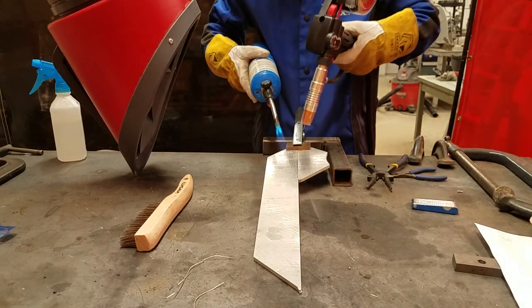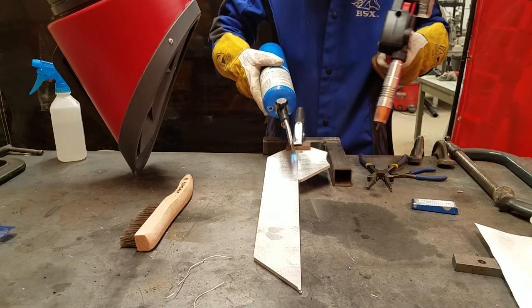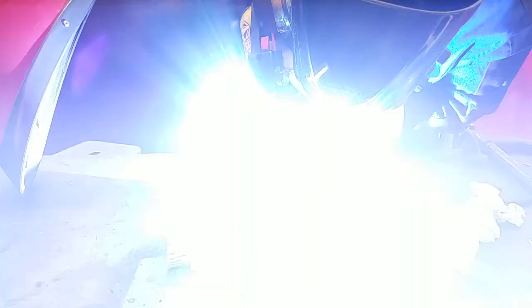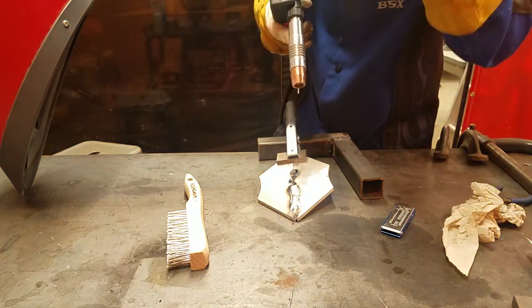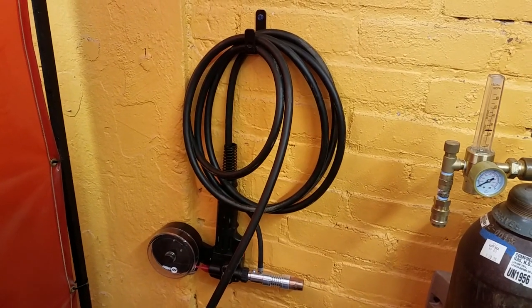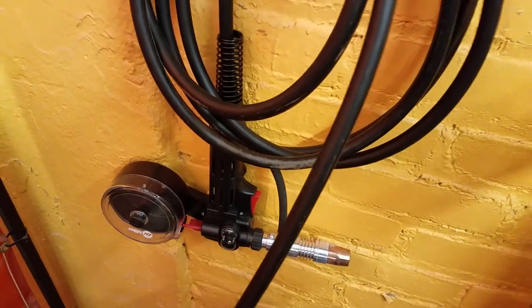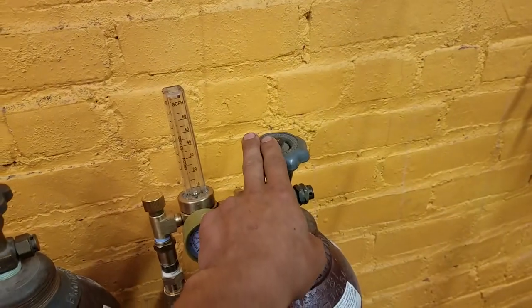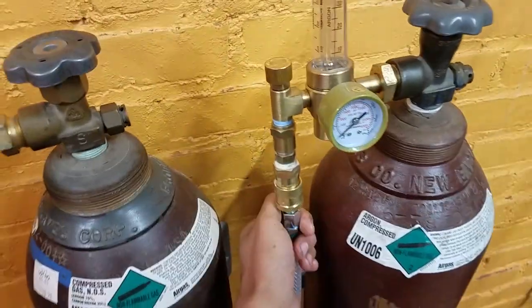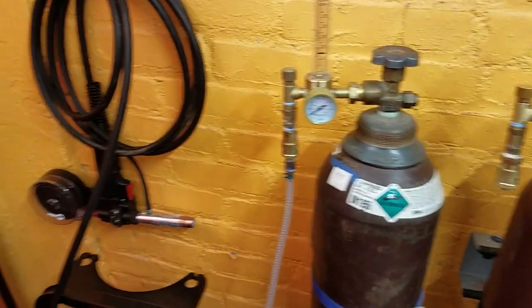Alright, we're at a pretty good temperature. Now we can try welding. As mentioned, we want to be using a push motion: tilt it a little back, go forwards, and keep about three quarters of an inch away from the material. When you're all finished up, make sure to hang the spool gun back on the wall and disconnect it from the MIG machine. Put the aluminum in the plastic bag back on the shelf, clean up the nozzle if needed, and make sure your tank is totally turned off. Swap the gas back to the CO2 argon mix, clean off the work bench, and you're good to go. Have fun.